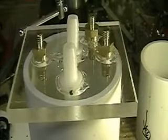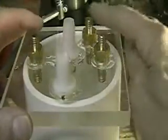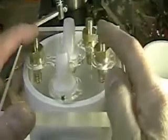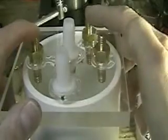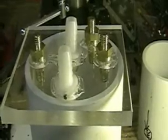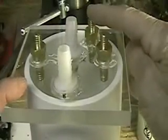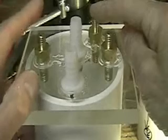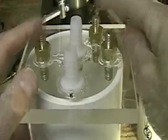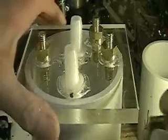If you look at the cell now, you'll have noticed that I've now got 3 electrodes on here. These 2 support the cell. The 3rd electrode supports the water sensor. And the way that's going to work is the 3rd electrode will be in common with the negative side of the plate. And that's going to give me the water sensor. And the way that works is this.